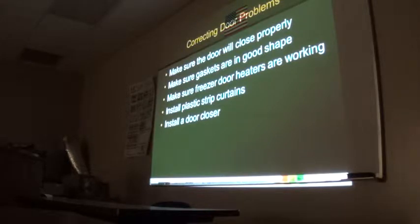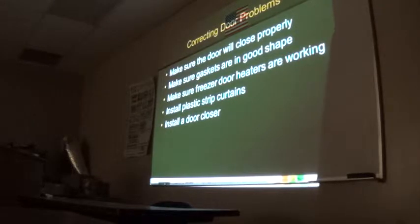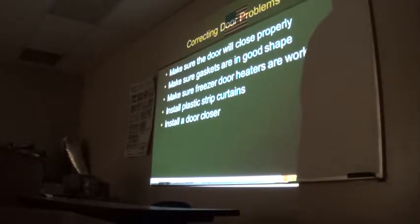I just didn't know if you needed to stretch it a little. No, you don't even need to stretch it because it comes to exact size. Yeah, sure, you're right. So it snaps in and you just tap it in, make sure it seats properly. And sometimes you may find they come kind of wavy. We need to take our heat gun and heat the gasket while it's there, and it's magnetic, so it's going to expand and the magnet draws it in and it seats properly. You need to have it seated properly before you leave the job, so the heat gun does that.